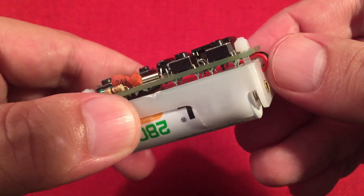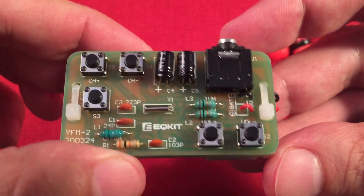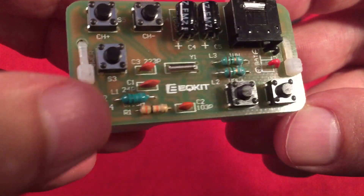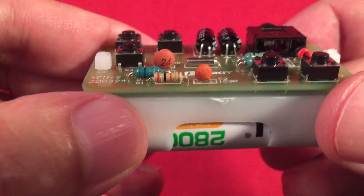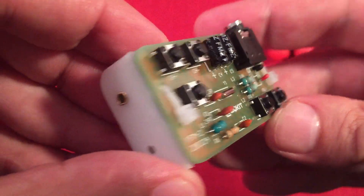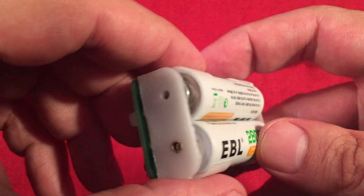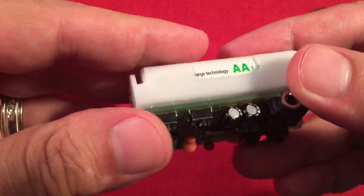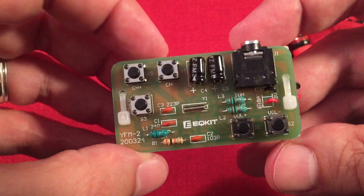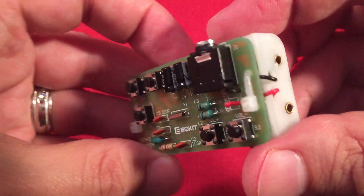You definitely want to give yourself some extra wire length — just give yourself a little extra just in case, because you don't want to cut it too short. There's some zip ties holding it together. You've got three inductors, your resistor, three disc capacitors — everything seems to sit pretty low profile, you don't have to really fold those down. The bottom here takes two AA batteries. They're kind of tight fitting but it's pretty neat. It showed in the instructions that this only consumes 19 milliamps — that's pretty low. I imagine these batteries will last a long time.